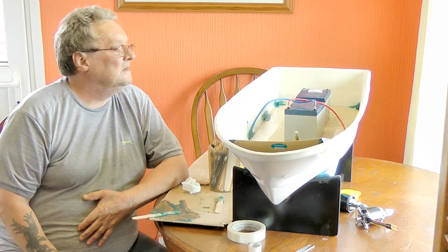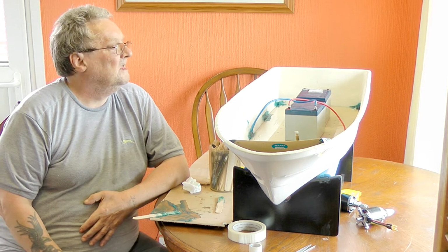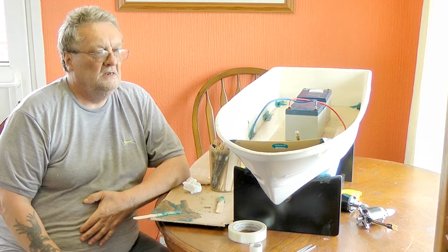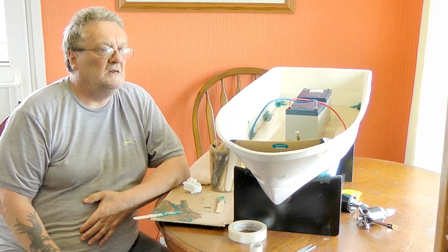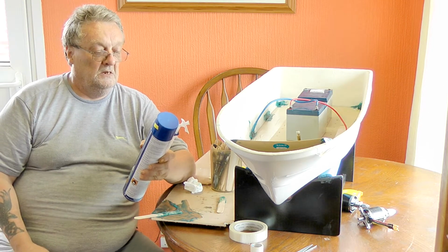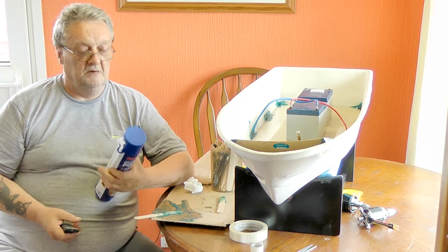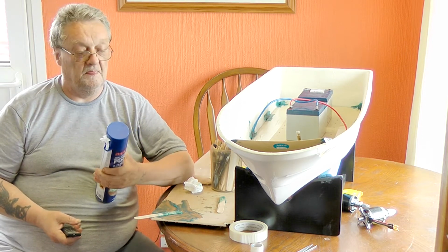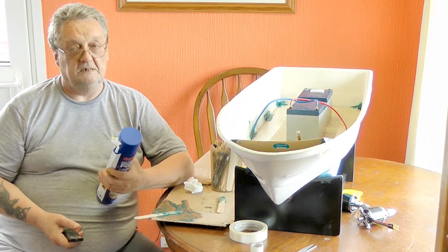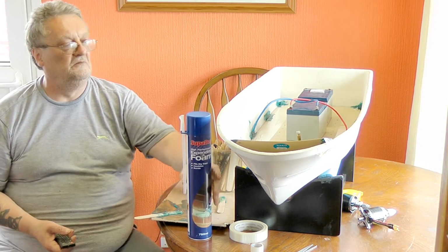Water cure, and then we get the expanding foam, shoot it through the 3 access points and wait to see what happens. Super Deck high performance expanding foam fills big gaps, insulates and bonds. Predominantly closed cell foam, so it sounds like the right stuff. It expands more than 30 times its initial volume.